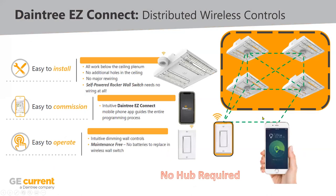This is how it looks once commissioned. When you use the app, multiple fixtures can communicate through a non-linear path to each other as nodes — this is mesh networking. You can tie in a switch, and our switch for the Easy Connect system is battery-less. It's kinetically energy-powered, so physically moving it with your finger powers that switch. You don't have to worry about a maintenance schedule to check battery levels — it will continue to work because it's self-powered.